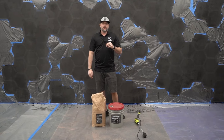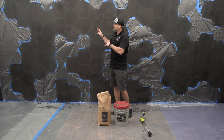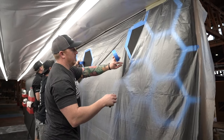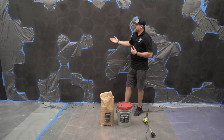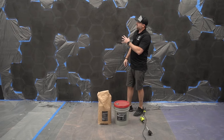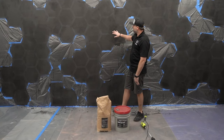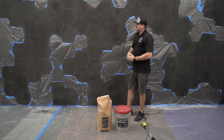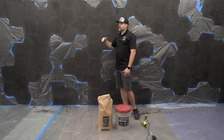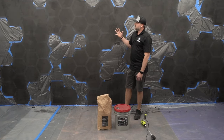Now we're ready for our first texture coat — we're going to be doing gray. This might seem like a lot of work, but it's actually not. You can get to this point in about a day. Taping the design takes about two and a half to three hours, another hour for the plastic, and rolling on the black was fast — so four to four and a half hours max. We're going to mix up our gray texture coat. Unlike the black scratch coat, this one has aggregate and crushed marble, so it's going to completely cover the black and give us a gray surface. I'm probably going to do two of these coats because I want the honeycombs to be thick and chunky so they really pop out of the wall.